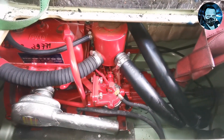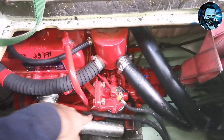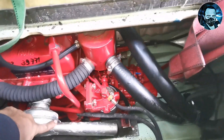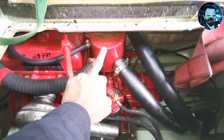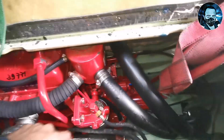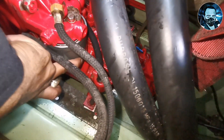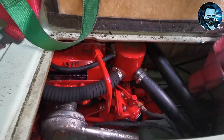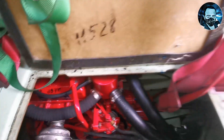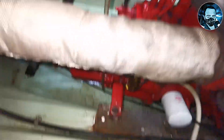Let's check the cooling water and anti-freeze content, then let's check the fuel filter. Here is the cooling water expansion tank. This is the fuel filter — it is clear in grey color. If you open it, you can inspect the fuel filter. On the port side, we will make the necessary changes. In the white color, this is the lube oil filter — we will replace it.